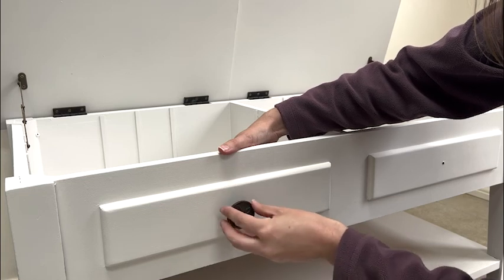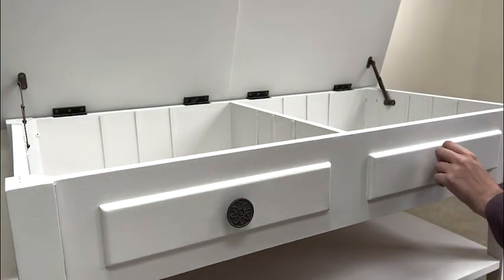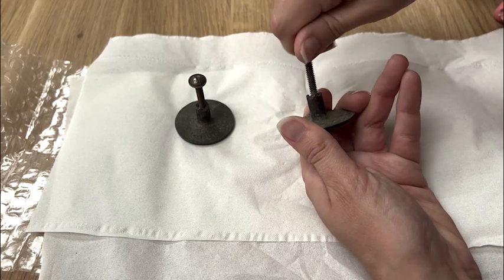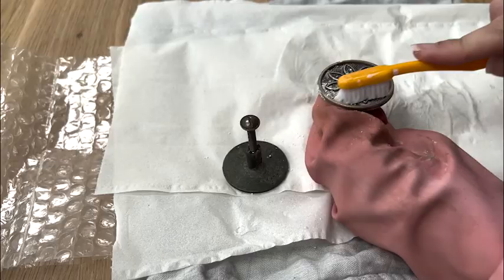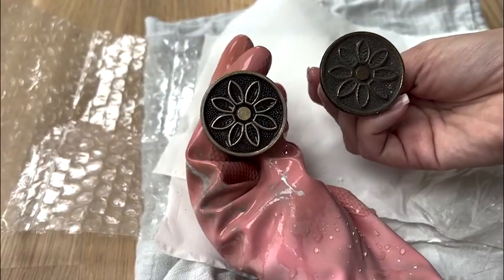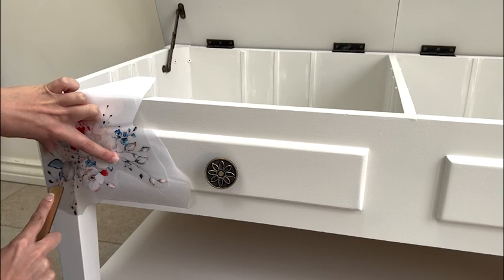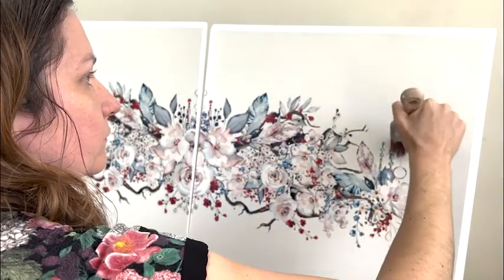Before doing any more transfers I decided on which handles I wanted to use — the shortlist was floral handles and plain wooden handles which I would have painted. I liked the floral handles because they were a nice nod to the transfer, and cleaning them up was really easy: just some Bar Keepers Friend and a toothbrush to bring the edges of the circles and the flower detail back to their shiny original colour. With the handle chosen I was able to choose which extra transfers to apply around the drawer area to add interest from both the side and the top, and finally I sealed the entire piece with two coats of clear coat in satin for extra protection, since a tabletop is probably going to come under some stress.